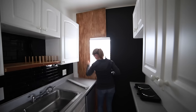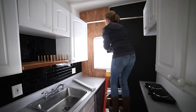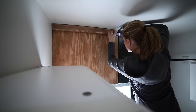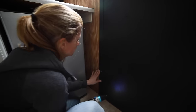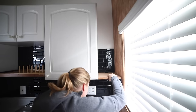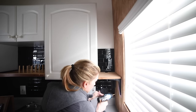I really like the asymmetry and shapes created by the different colors and the window — let me know in the comments whether you would have kept everything black or prefer the two-tone. To finish off this feature wall, I added a one-by-three at the top which hides the gap between the panels and the ceiling and connects the two panels together. The window valance also helps keep the panels flush against the wall, along with a piece of molding that covers the gap between the two panels along the middle. The last piece of the puzzle was adding shelves cut to fit snugly between the cabinets and the plywood to keep it pressed against the wall — and the nice thing about having this plywood is that you can screw into it without putting any holes in the actual wall.